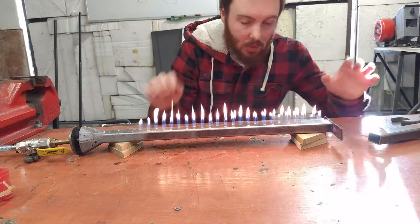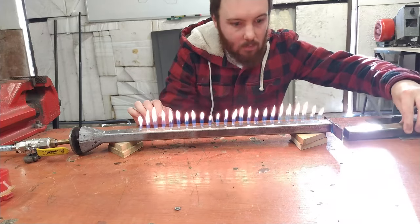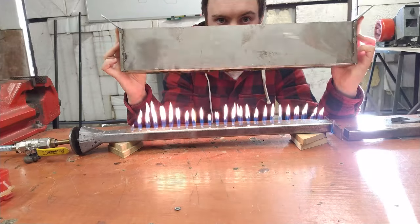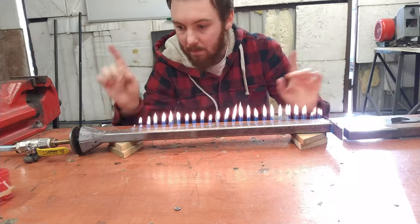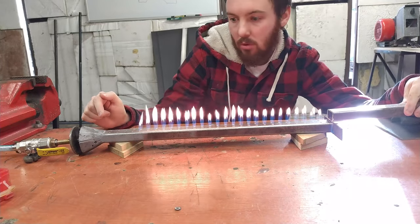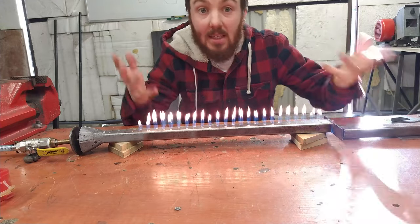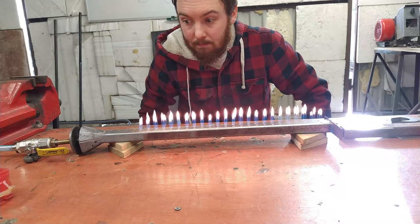So what I'm going to do is increase the length of this burner, because I need 50 centimeters of flames, exactly the same as the width of this container. So the plan is to weld this hose, increase the length to make the flame, or let's say the heating area, exactly 50 centimeters wide, and make the cover.